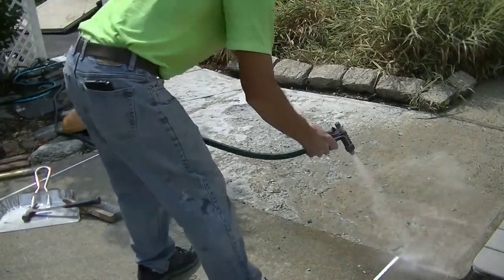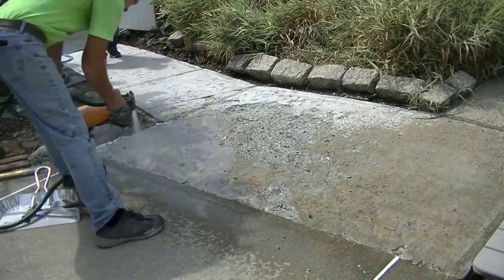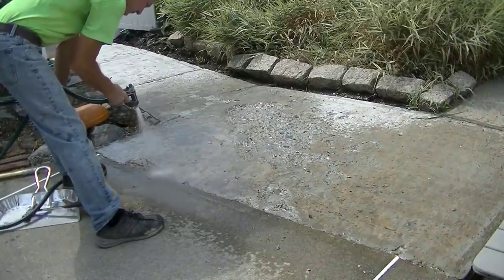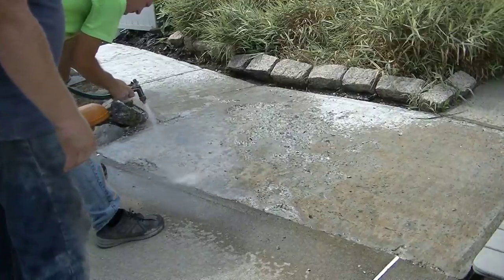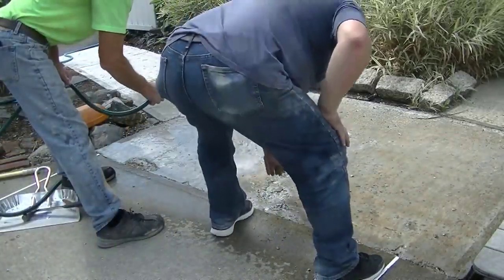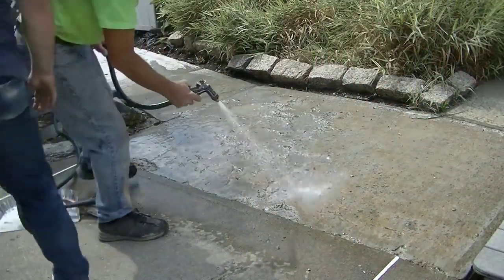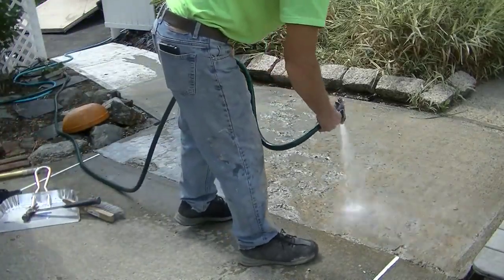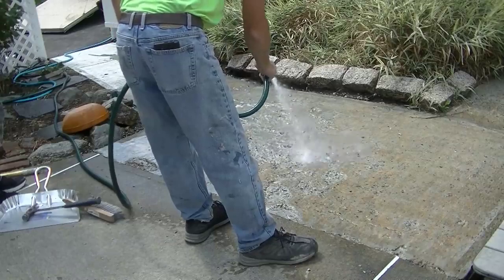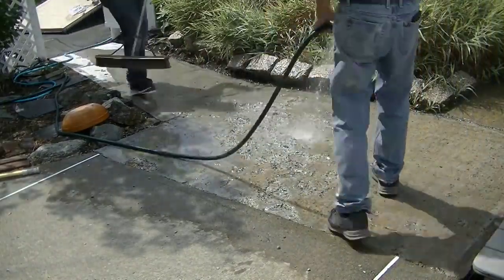So this is part of the next step — I'm going to rinse this off, and it does a couple of things. Rinsing will remove some of the dust and loose particles left behind that the vacuum didn't pick up. It's also going to wet the concrete. When we resurface or make repairs, most of the time the products we use want a damp surface — not wet, no standing water or puddles, just damp. It's called SSD: surface saturated dry. That way the existing concrete doesn't suck the moisture right out of the repair too fast.